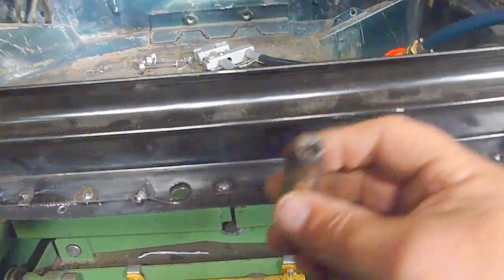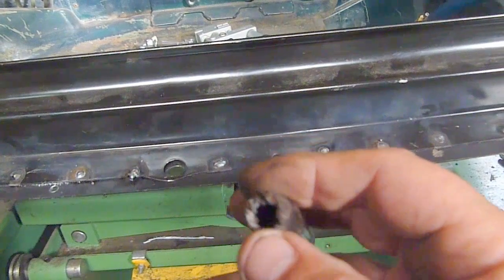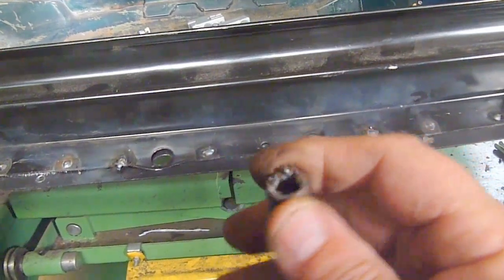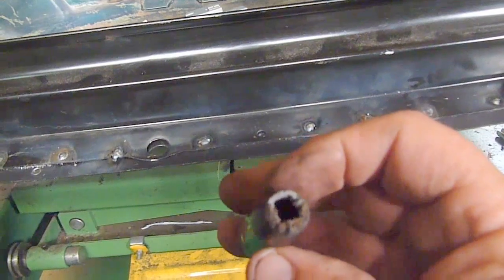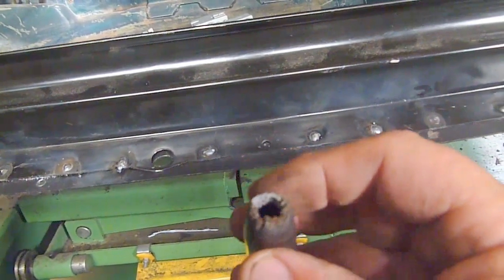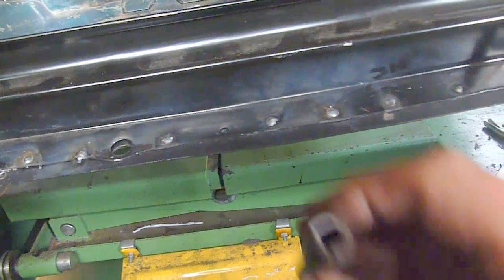It's a lot easier. This is the standard nozzle here, and you can see this is a real problem with them. When you're welding with them quite a lot, you get a lot of build-up inside. What that does is it diverts the shielding gas around it in a bad way, or it doesn't get through, and it causes problems. It's very easy to clean out — you put a screwdriver in there or whatever, and the slag inside will just come off very easily. The cleaner it is, the better the weld you'll get.